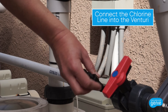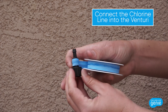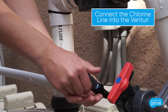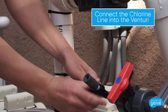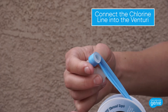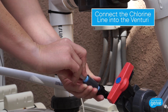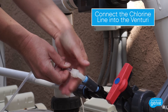Now we will connect the chlorine line into the Venturi. Unscrew the barbed fitting of the suction port from the Venturi. Wrap the threaded end of the barbed fitting with 3 to 4 wraps of Teflon tape. Locate the 1/4 inch female coupler and screw the barbed fitting onto it. With the newly assembled piece — the barbed fitting and coupler — thread the assembled piece onto the Venturi. Hand tighten until it stops twisting; be sure not to over tighten as the barbed fitting can break. Then locate your 1/4 inch Kynar elbow and wrap the threaded end of the elbow with 3 to 4 wraps of Teflon tape. Screw the elbow into the open end of the 1/4 inch female coupler and face the elbow toward the Chlorine Genie unit. Attach the 1/4 inch Teflon tubing into the elbow and hand tighten the fitting on the elbow to secure the Teflon tubing.